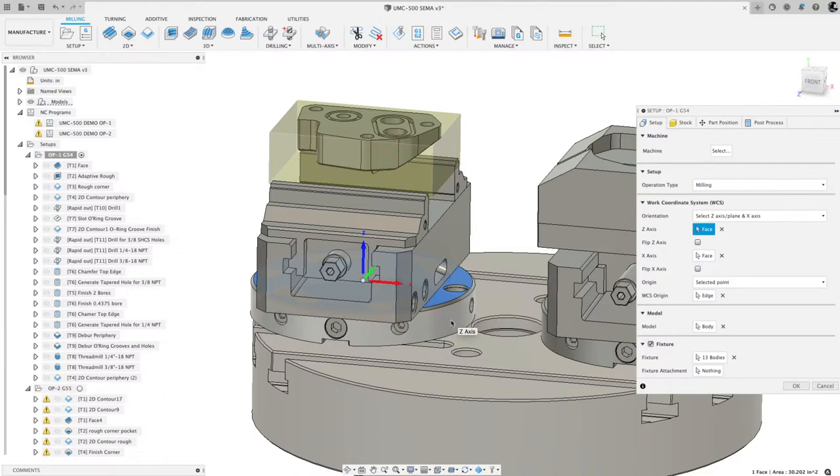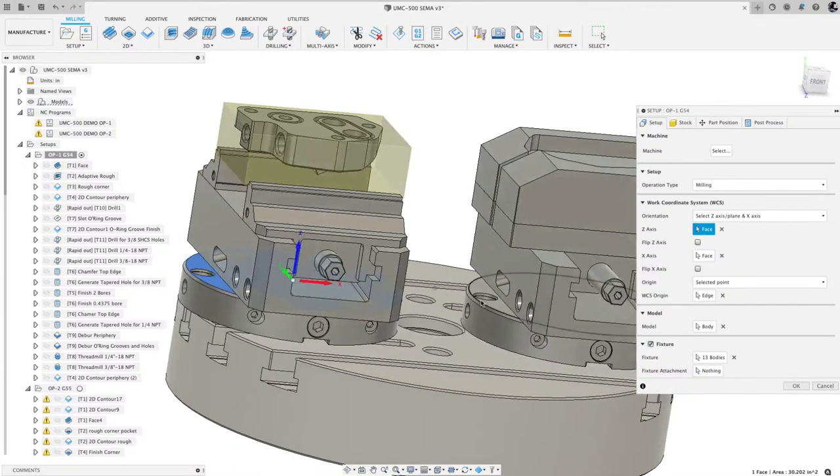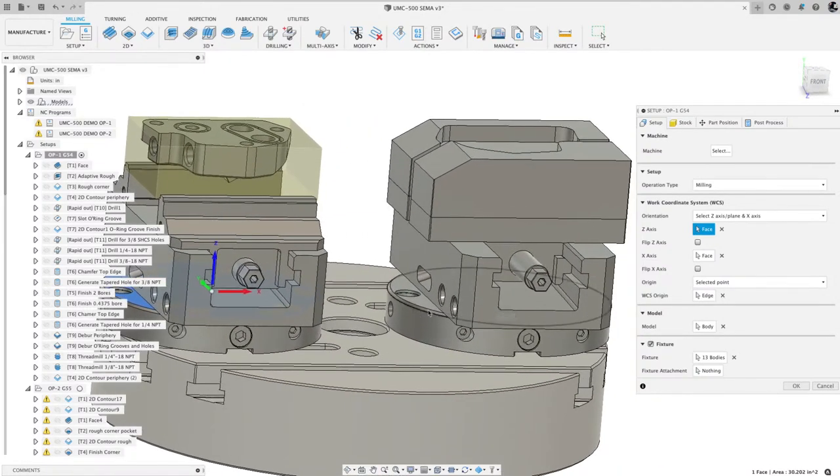These are intended to stay always bolted on your machine tool. So once you have that coordinate, the zero point where that lives, that white dot right there, that never changes. And then you can take the vise off. You can put a bigger vise, a smaller vise, or another fixture that mounts in there, and you don't have to go back and find your zero. Same thing for the secondary operation. I did this guy here. I'll get to that when I get to the second op.